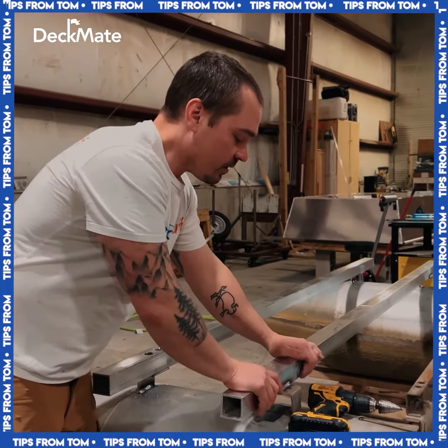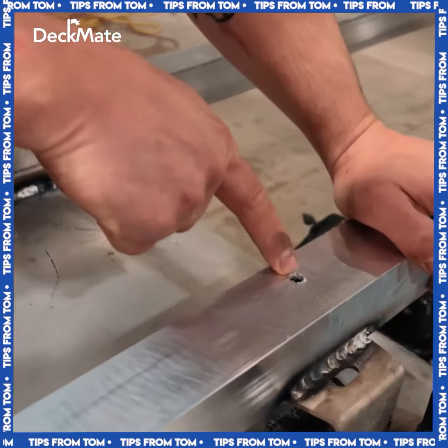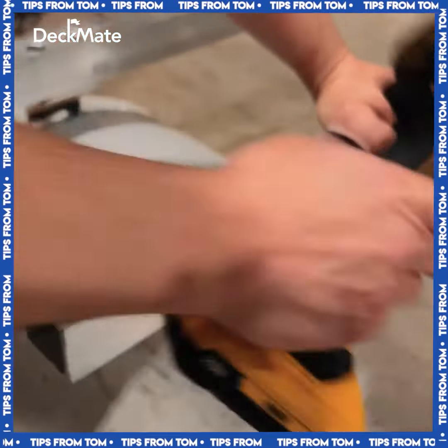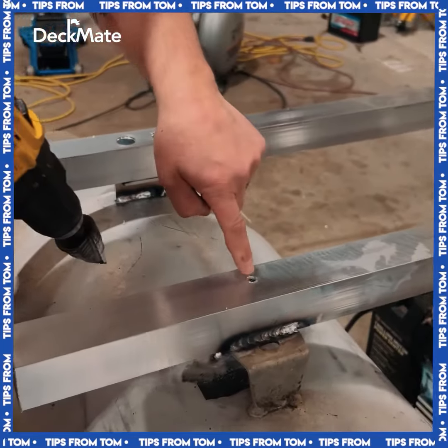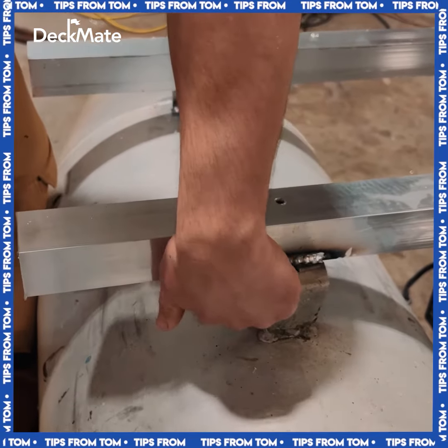In order to secure this, what I've done is I've drilled a five-sixteenths hole. I'm going to use five-sixteenths hardware to hold this together to the bracket. Then I'm going to take a step bit — this is a big step bit, it goes all the way to an inch and three-eighths — and I'm going to go ahead and open my hole on top. My hole goes all the way through my tube into the bracket down here.